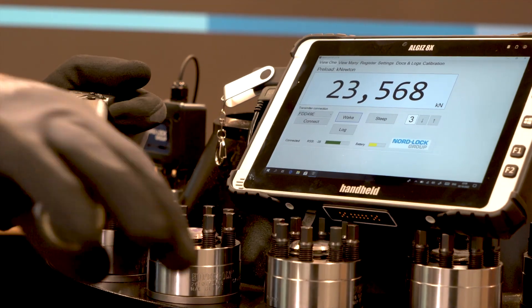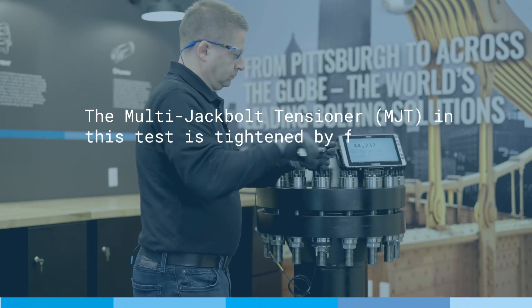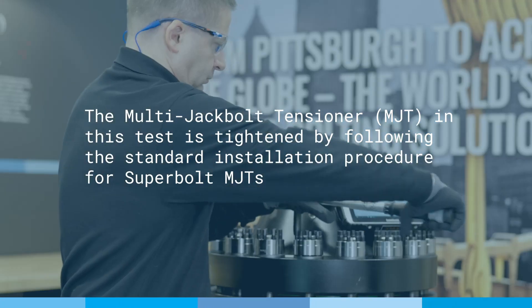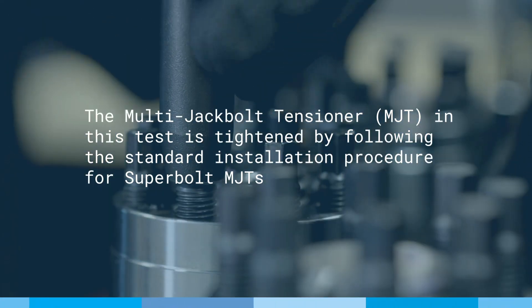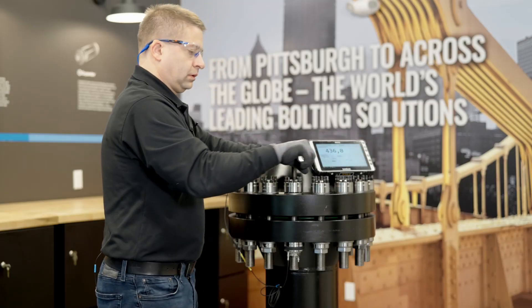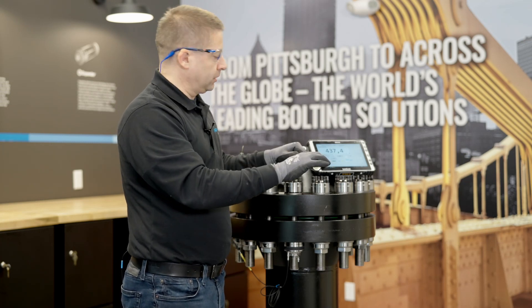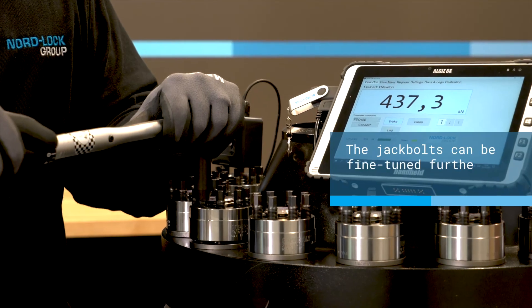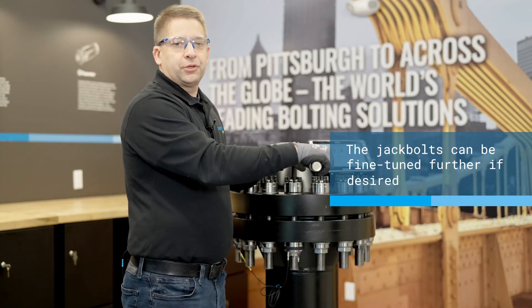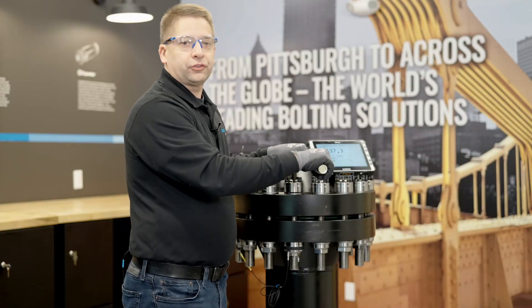You can see now we have a readout. The wrench has moved less than 20 degrees. We don't need to carry on anymore — we have a value of 437 kilonewtons, way better than 5% accuracy. This is a tremendous achievement with the Load Sensing FlexNut.